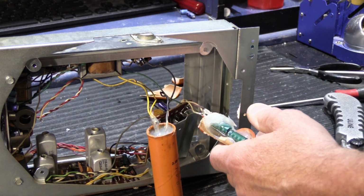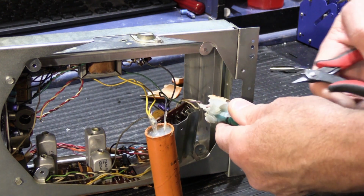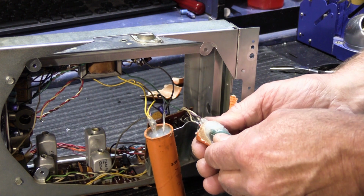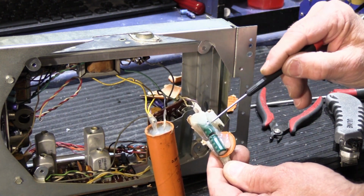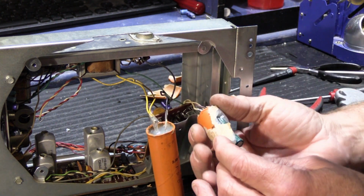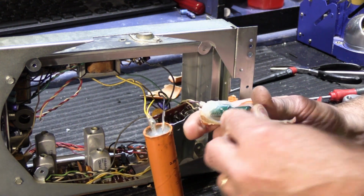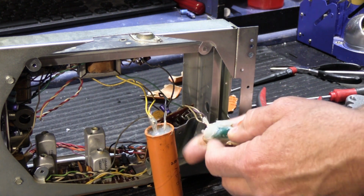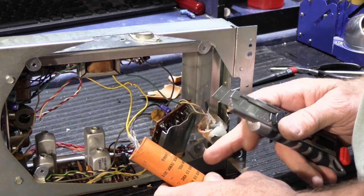And it's a little hard to get apart. Maybe it's probably not going to come apart all the way because there's so much glue. But what you can see here is these green, these are radial capacitors. I can't tell you the values, I don't think, because the hot glue is kind of in the way. They are 470 microfarad at 50 volts, which is close to what they're supposed to be, but not really exactly right.